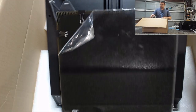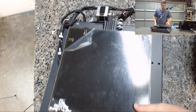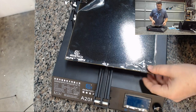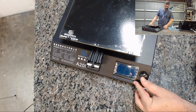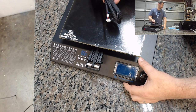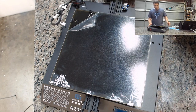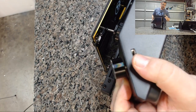Here is our base. We have the motor on the back, on the front of the Y-axis we have the bearing plate and the belt going across. This also has, as an upgrade to the A10M, a full graphic LCD — so it has the larger size display. It's pre-cabled, so all you do is plug the leads out to your different motors.